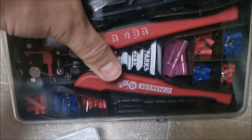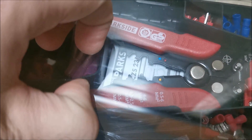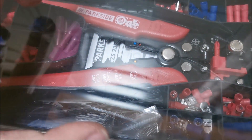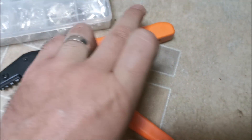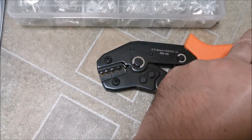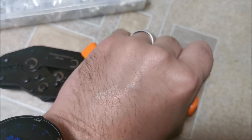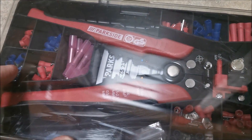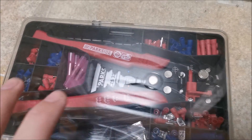It's this one — it will be linked in the description — and it crimps right here. So it's just relying on the strength of your hand to crimp, which is not nice. This one has all sorts of levers, so a big movement in here translates to a much smaller movement in here, amplifying your strength. This one doesn't really do that, so in my opinion it's a much weaker tool.